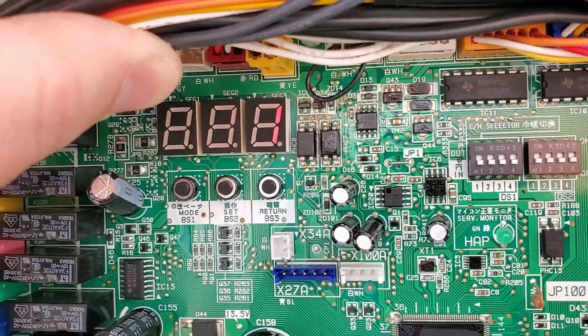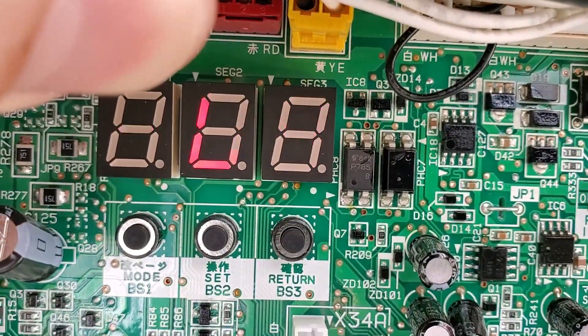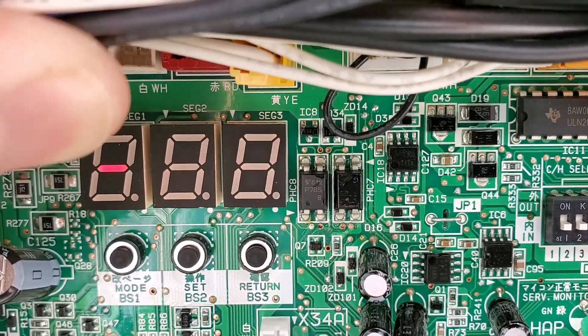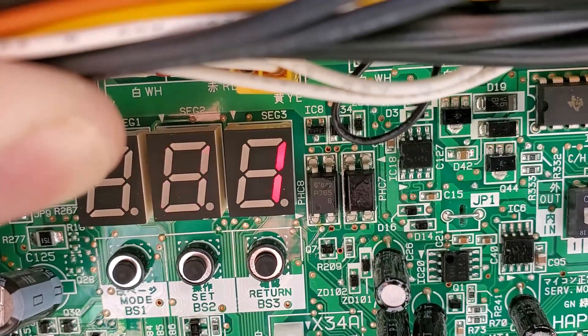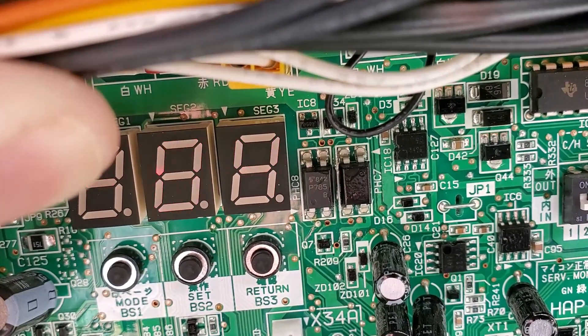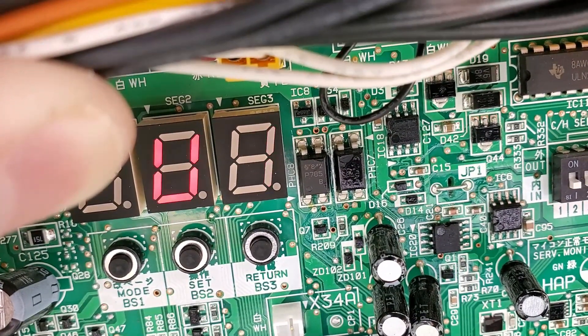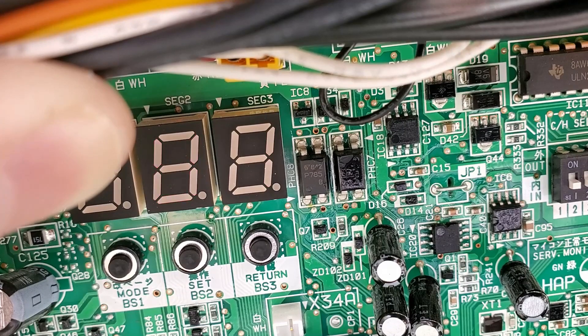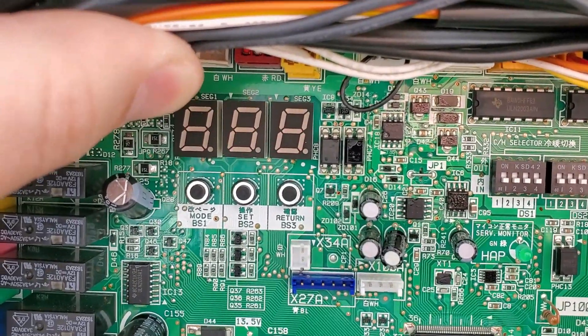When powering up the outdoor equipment, check for any U1 error codes — there's a 30% chance one or more of the outdoor units got wired in reversed phase. Both modules had reverse phase in this case. Not to worry though, it's an easy fix — just flip two legs and you're good to go. Note that my camera's refresh rate didn't match the LED screen of the outdoor unit, so while it looks like a garbled mess on camera, I'll walk you through and explain it along the way.